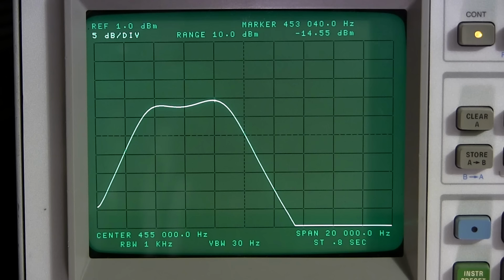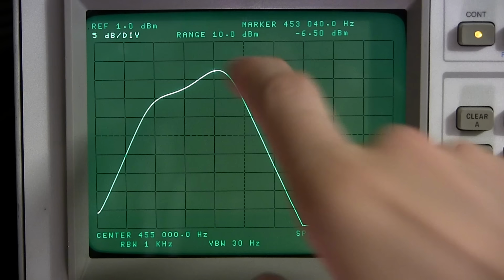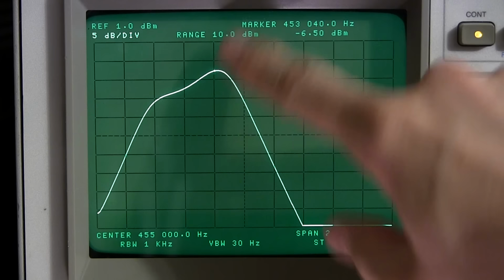So in the end, we would want to peak this up, and that's not what the pattern's supposed to look like anyways. It's a really wide pattern, and really, even in the AVC position, it should look like this. So, of course, with that coming straight down without this little dip here. So what we're going to do is try and peak up this pattern. We're going to go for maximum amplitude right at the crystal frequency. We want to keep this right at that crystal frequency.